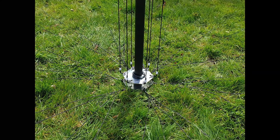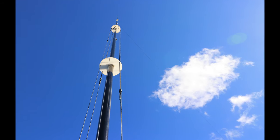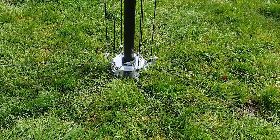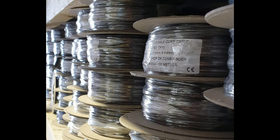The DX Commander concept has a number of quarter-wave elements made out of wire that rise vertically from a radiating plate. The resonant frequency is automatically selected by the very nature of the laws of physics — there are no switches or control lines. Each element works completely independently, as a fan dipole might.